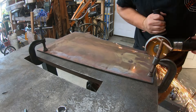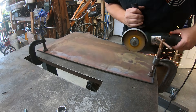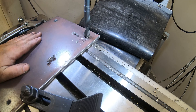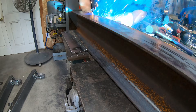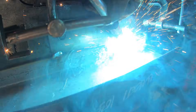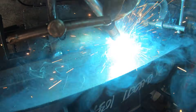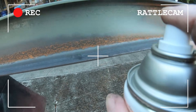Making the replacement for the top beam was pretty simple. My new I-beam came cut to the right length, and all that was needed was a pair of mounting flanges — just rectangles made of quarter-inch plate I had in one of my scrap piles, with holes drilled to match the originals. Normally, not being certified or anything, I would never weld something that hangs over people's heads unless there was a lot more redundancy in the system than this. But these are big, simple joints that aren't seeing weird loads — it's mostly just compression, with maybe some tension towards the outside. And again, as long as it's just my neck on the line. A quick coat of paint to match the original, and the replacement beam was ready to go. Wider — check.